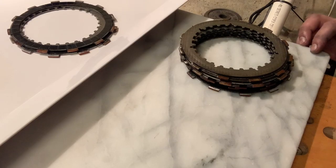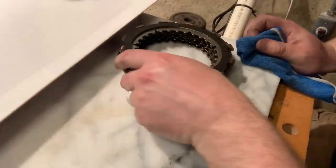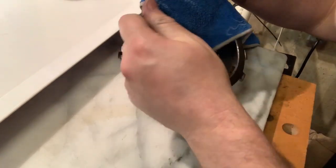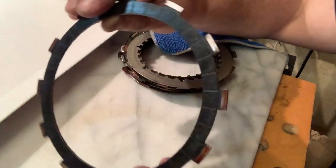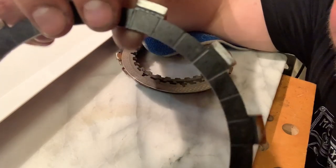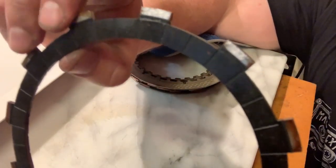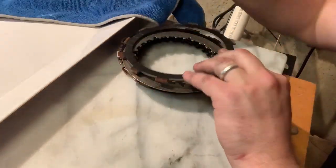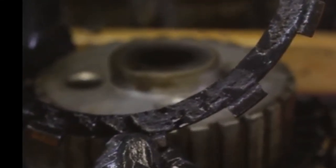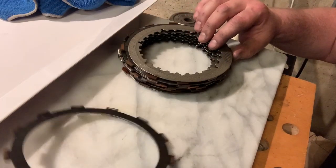Should be pretty exciting. I'm not anticipating seeing anything wonky. Just take your time, inspect each one. These all checked out really, really well. So basically all I'm going to do now is look for any crazy signs of wear. You can still clearly see the indents on this. Take a look at these pictures from one of the Common Motor videos — this is not always the case. So this is really encouraging to me that these friction rings are actually in good operational order. I'm in good shape compared to these examples of worn-out friction rings.